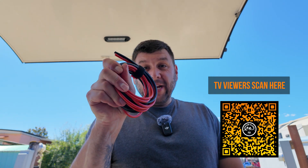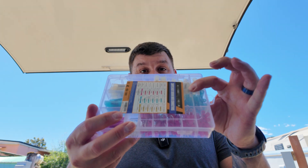Some of the upgrades: 10-gauge wire to go from the Victron to the battery, with a 10-gauge inline fuse that will have a 40-amp fuse on it, but I'm going to limit the Victron to 30 amps. When I used my 12-gauge 20-foot extension cables they barely fit, so I picked up some 30-foot 10-gauge extension cables to help ease the voltage drop from the length of cable. And because we're going to be pushing more power, let's get back under the sink and change out that 14-gauge wire for 10-gauge.